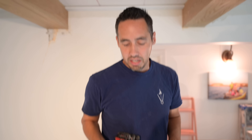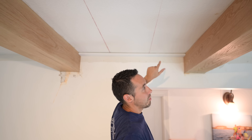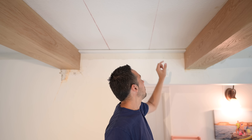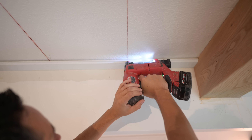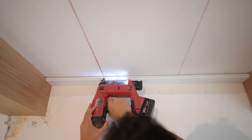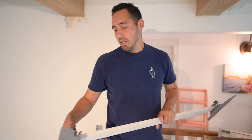This is going to get caulked and all refloated out. It's going to take a long time. Let's do our next piece. We're using 18 gauge brads and doing a blind nail. On our joist here, that's our firing location where we're going to fasten these. The blind nail is where we shoot into the tongue at a slight angle so we don't have to fill any nail holes. I go right on my red line, give it a slight angle, send it. Our first piece of tongue and groove is in.